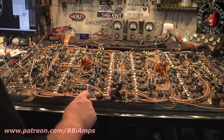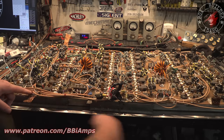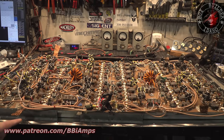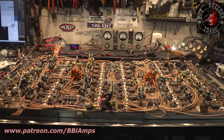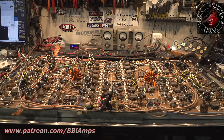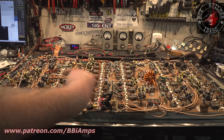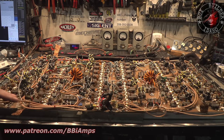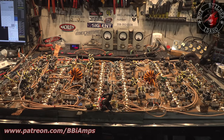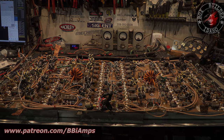I need to come back and get rid of all these braid wires and unsolder all this garbage, unsolder all of that garbage, right? Clean all this up. Have to create my support ribs. Got to bolt all of this together. Got to get the heat sink squared up, and I got to stabilize these pallets. Pallet one, pallet two, pallet three, pallet four. Stabilize it this way and this way, so we're not flexing it anymore. We've got to create an environment where it's not trying to bend itself in a U and it's not trying to split itself in half. I've got to be able to move this around without us breaking parts. So that's next. Okay, school's over.